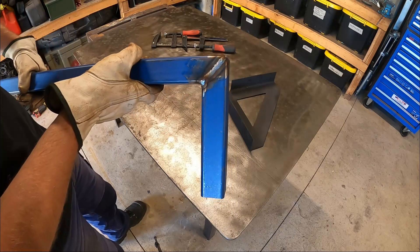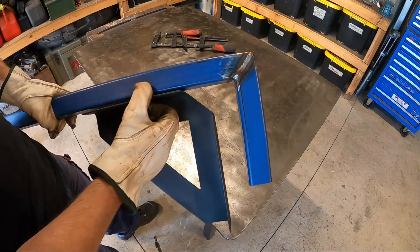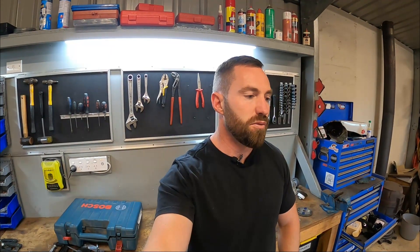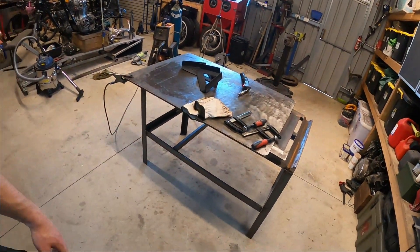There we go — that's one perfectly square mitre joint. So that was making 90 degree corner jigs, just a nice simple one. I was almost going to do this off camera, but I thought it's worth making a video on. They'll make it a hell of a lot easier when welding up frames and actually keeping them square. I have just been doing them on the floor of my garage, which isn't level, and the results are less than ideal. So the next time you see these ones, I'm going to be using them to weld up the frame for this welding table. Thanks for watching guys, and I'll see you then.